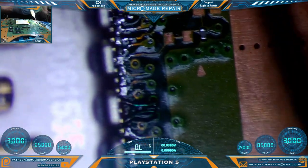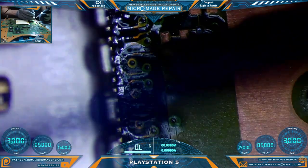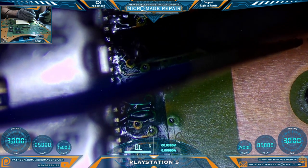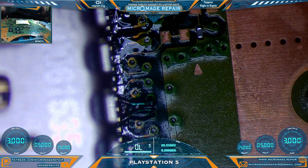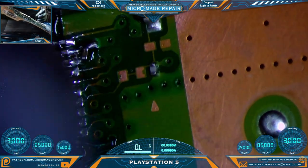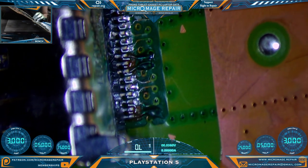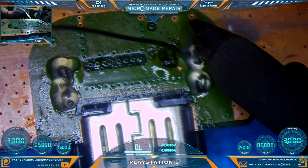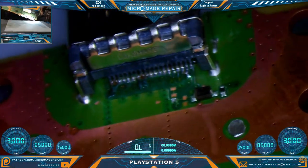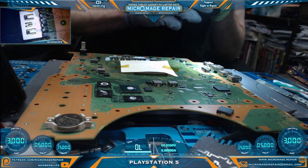It's going to be this one here. That couldn't have gone much better. Let's see if we can get that solder with our Pico pencil — we'll give ourselves a little more steadiness with the tweezers. I think that went well. Excellent. Everybody's making connection that should be making connection. The ones that are not were ground and were the ones we were not going to worry about. Now that does not mean that this is going to work — there was severe damage done here, and it could have been another problem to begin with; we just don't know. Get our anchor soldered. Excellent feed-through. Next step is going to be to clean thoroughly the port inside and out, and then we'll reassemble and cross our fingers.